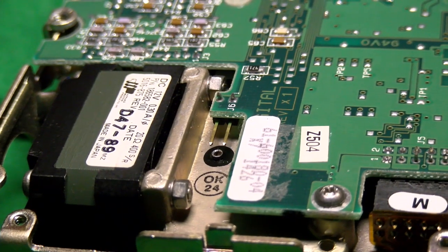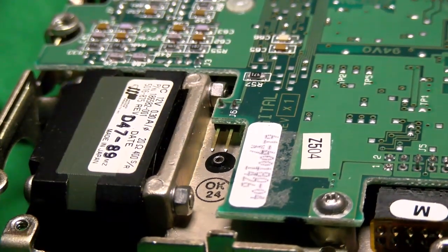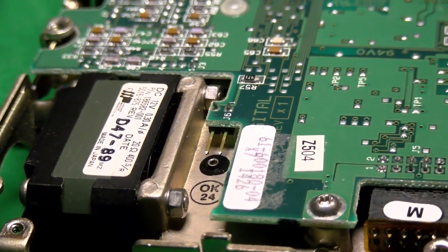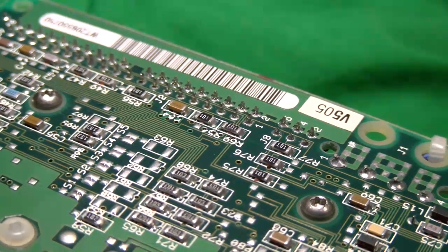Personally, I think it just has a bunch of things going on with the boot process. I mean, for a start, I guess the hard drive host adapter has to take over. I really don't know how much that does. Most of the electronics are on the hard drive. It's the thing with the auto detection. You'd think that should be there on 16-bit, because it's IDE, integrated drive electronics. The hard drive is doing all the work. The card's doing very little. But it could be something to do with that, or it could just be DOS. Maybe it uses a light form of compression and we decompress to RAM on boot. I don't know. The 286 does this as well.